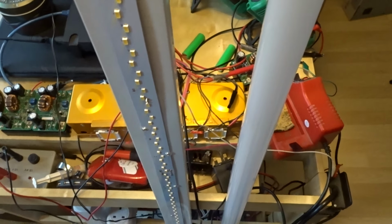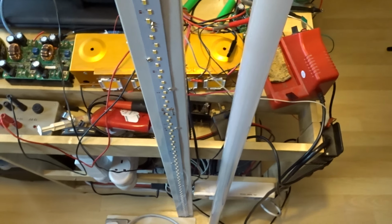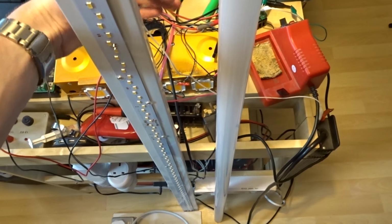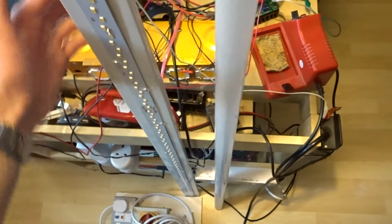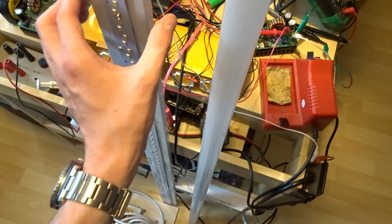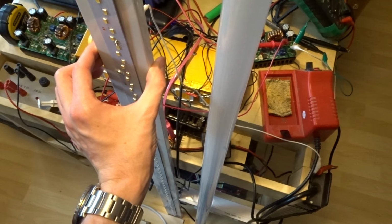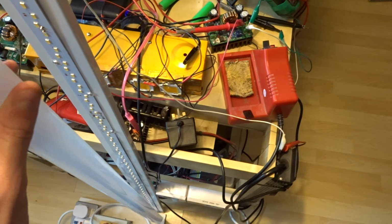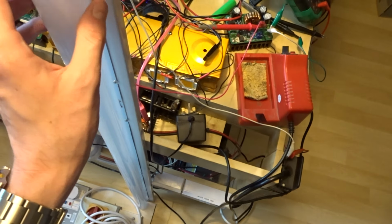67-inch LED fluorescent style light. It's not a drop-in replacement for a fluorescent fitting, it's a complete all-in-one unit. There's normally a back box which is the power supply circuitry, which I assume is a switch mode power supply. And then you've got this front section which is a replaceable section of the light. It had this diffuser on the front which is not phosphor but it's plastic.